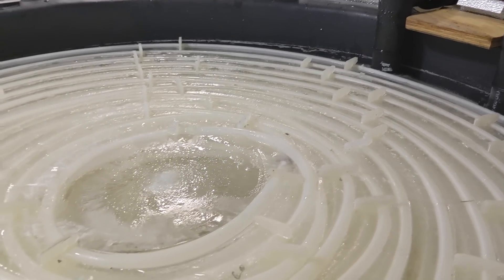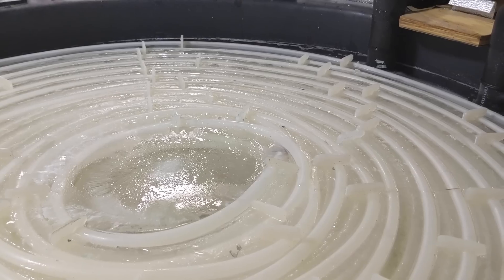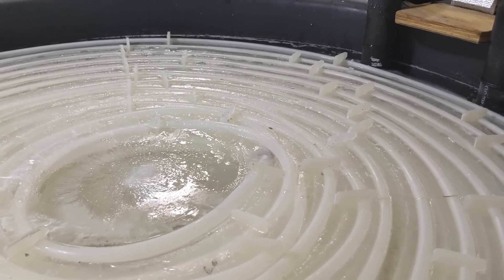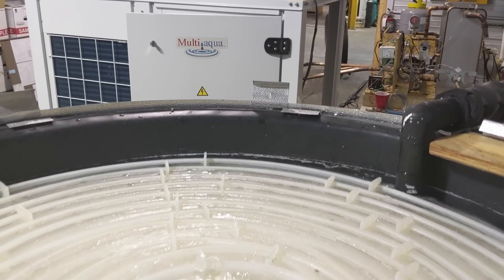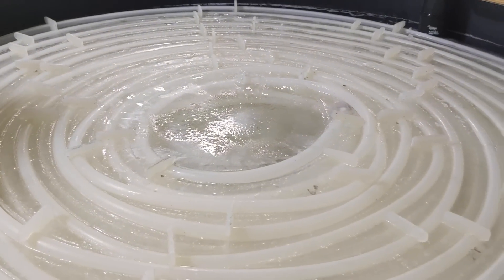This is a 30-ton hour block of ice, meaning you could run your four-ton heat pump for over seven hours off of this, and that compressor and chiller would never come on. In theory, you just have your circulating pumps and you could cool your home — cool the space — with just ice.